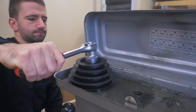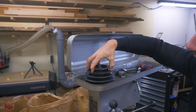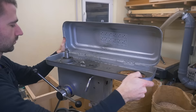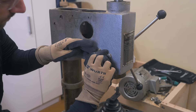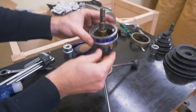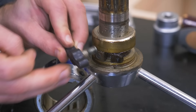That wasn't actually that tight, but this requires the gear puller. It was a cone — now it looks kind of naked. Look at how massive this depth stop ring is. And it doesn't just press with the knob onto this piece — there's a groove all around the handle shaft and a special shaped piece which fits there, and that's where the knob presses on. This is good stuff.